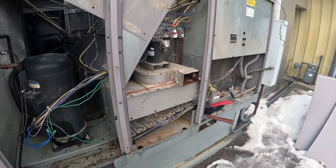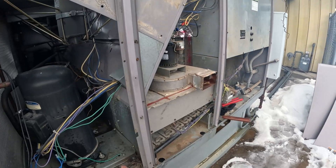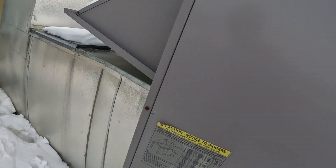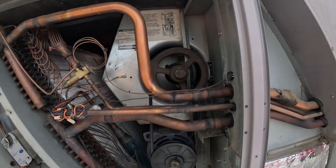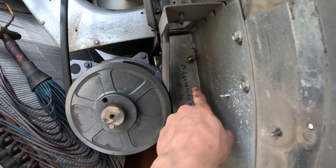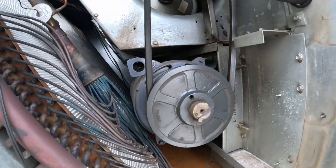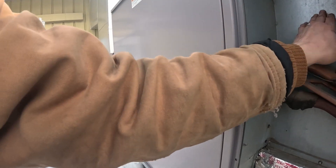For the first time it just started up. Of course I turned the power back on and it's a little bit smoky — there's oil on the tubes so it can smoke. We want to go inside and make sure the fire alarms aren't going off. The blower was a little noisier than usual so I decided to investigate that noise. The belt was really loose and slipping in the upper pulley, so I went ahead and tightened it — it's got about a half-inch deflection now. You just loosen these two bolts and the motor weight drops down and tightens it up. There's also some air leakage around here so I put some silicone around that.